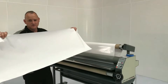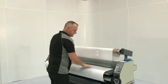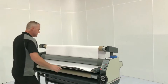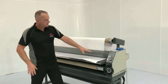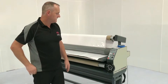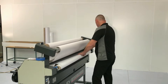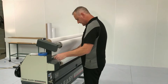What I need to do is I need a piece of scrap — it can either be just waste paper from our paper rewind, a piece of media — we just need something in the machine to stop on. So what I'm going to do is put that into the machine, start, and then stop it again. That's just let me get the last of our print out to the back of the machine and make sure my bottom roller is masked against any film. So now we'll move around the back, cut the old print off, and cut the film. Now around the back of the machine, we've got our piece of scrap we've put in here and our good print underneath. So now I'm just going to separate that off, take it off, and remove it from the machine to get ready for our next job.